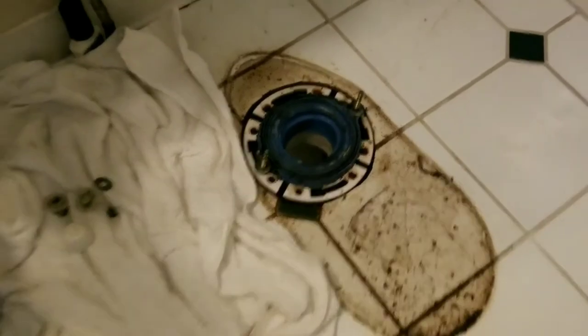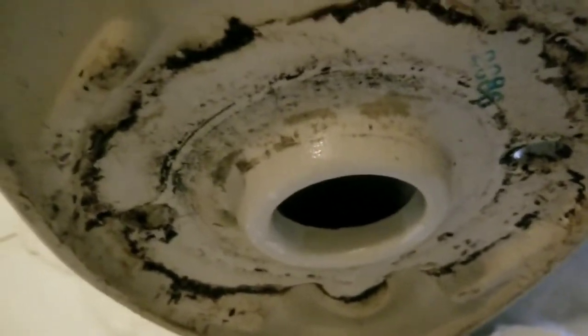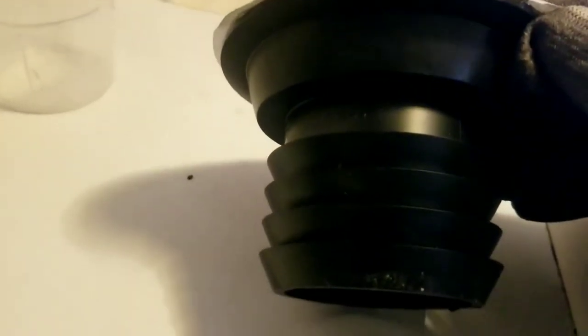So we've got a new ring we're going to put on, and we're going to make sure the flange down here is really clean in order to get this new ring to stick on there. Today we're going to be using a different type of flange. Instead of soft neoprene or wax, I'm using this semi-hard plastic hard rubber. It's like really thick hard rubber, and it has little barbed grooves on the spout that goes down into the drain hole to provide a nice tight seal so that any fluid that might back up doesn't leak out around it and come back up to the floor.